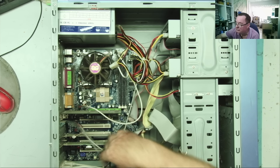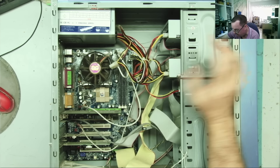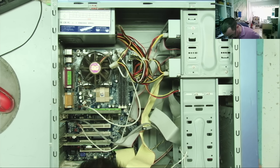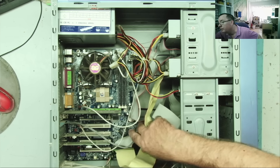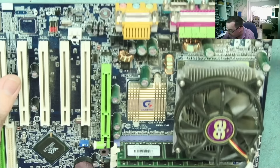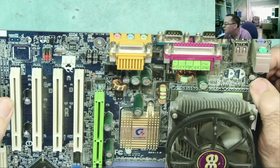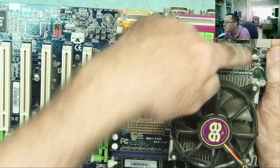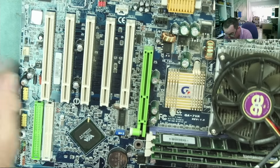No ISA on this one. I can see straight away a couple of bad capacitors — at least a couple. No hard drive in this one. So let's get this motherboard out on the bench. Do we see a model number? Yeah — Gigabyte, GA-7VA. I'm confident enough this is an Athlon machine. All the capacitors around here look okay, but this one has bulged, and I think it's the same type as these two and this one and this one — so we have five bad capacitors.